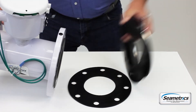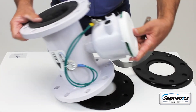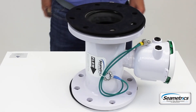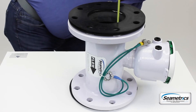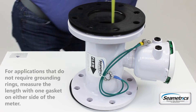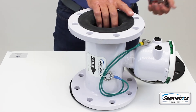For measuring the length of the meter, you're going to want to have a gasket, your ground ring, another gasket, your meter, gasket, ground ring, and gasket, and measure the full length of the meter, including the meter, the end bells, and all the gaskets and ground rings. So we have about 11 and 1 eighth inches here. Write that down because that's the length that you're going to need to cut out of the straight pipe when we get ready to put the meter in.